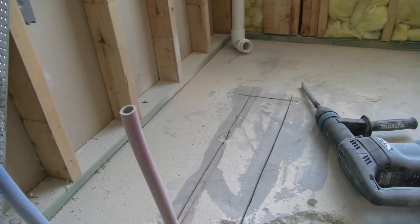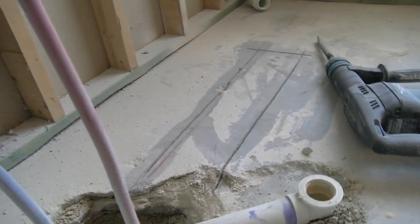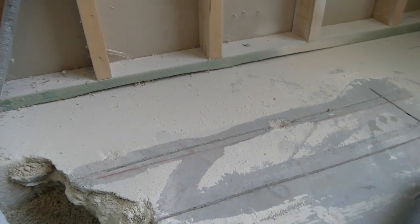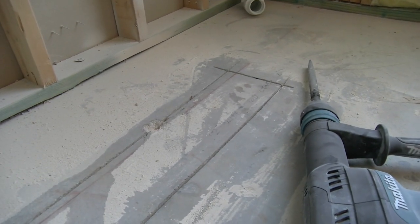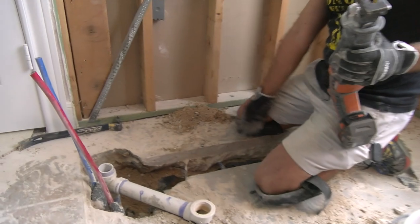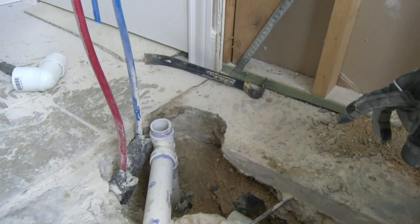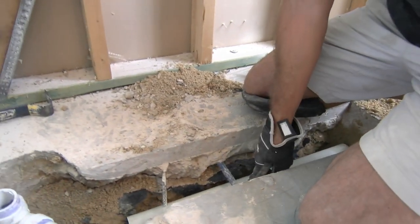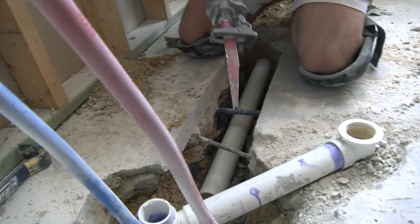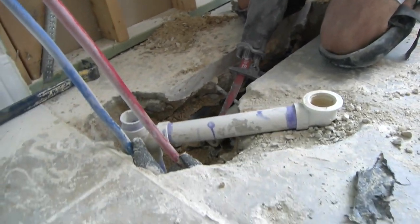We've got the board already cut now. We've still got the drain to go and haven't gotten down that part yet. We've got the drain cut. If I can get all this concrete jackhammered out, that's going to be a fun part because we've got about four to five inches of concrete to get out of there. We got the trench dug — it's completely chiseled out. Got our first layer of pipe in there. Now I've got to come back and cut out the old drain, and we're going to have to dig down even a little bit more because we have rebar and tensioner bar in the way, so we can't run the pipe at the level we want. We're going to get this pipe cut off — cut it with the Sawzall for a rough cut, then come back with the drill saw and cut it exactly where we need it.